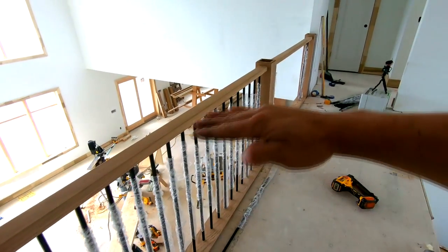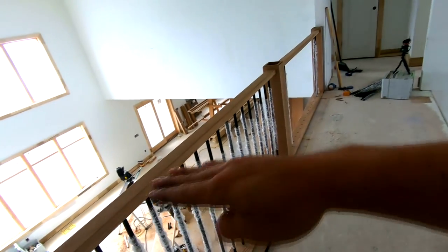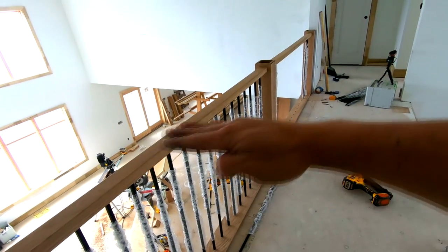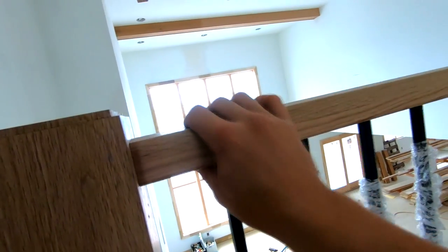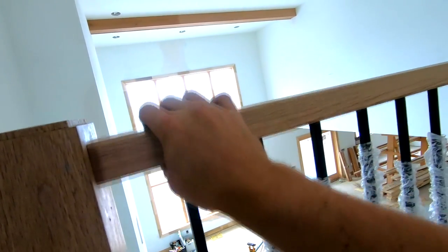I also want to point out the dip in this handrail. The other side is screwed, but look at how much that moves — that's the dip. Whenever I was cutting these, I saw the dip and made it so the dip faces down. I'll push down on both ends when I screw it, which will straighten the handrail out. If I'd put the dip up, there'd be no way to apply pressure to straighten it.